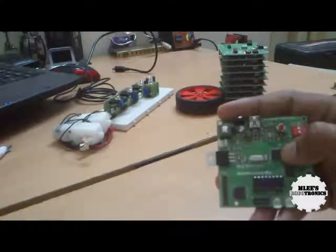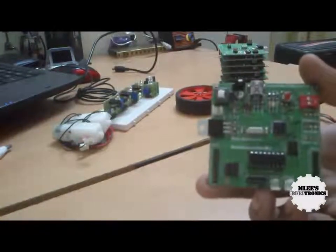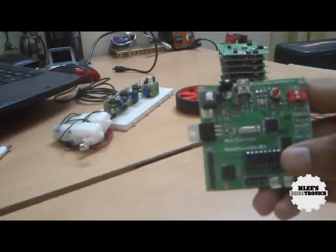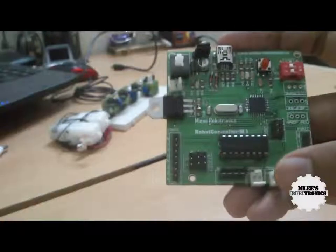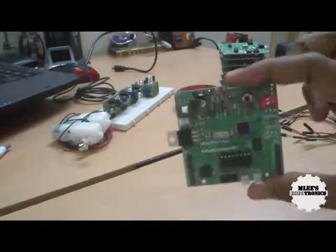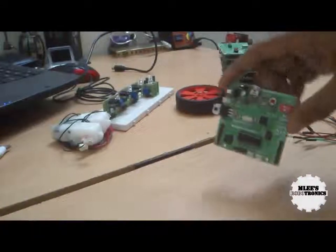Just the fact that we are running on an Atmega 8 microcontroller — we can also use an Atmega 328 microcontroller on the same board and use this board as an Arduino board. The shield compatibility will not be there but you have the complete freedom to use the Arduino IDE. A key feature of this board is the L293D motor driver IC, which allows you to drive two DC motors at a time. This board is always ready for a robotic project since you can drive DC motors without any problem, with bare minimum peripherals.